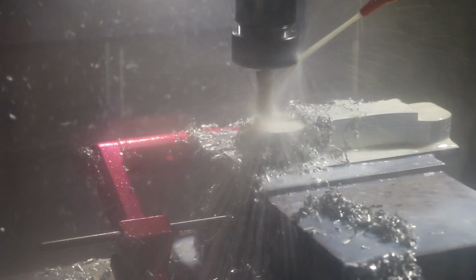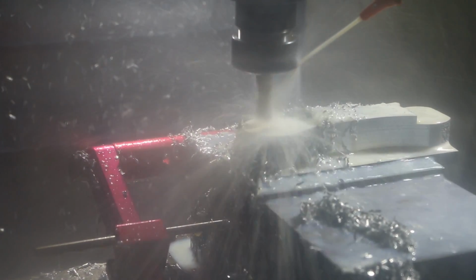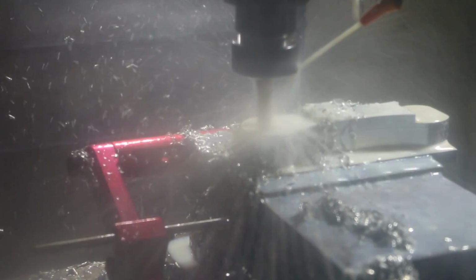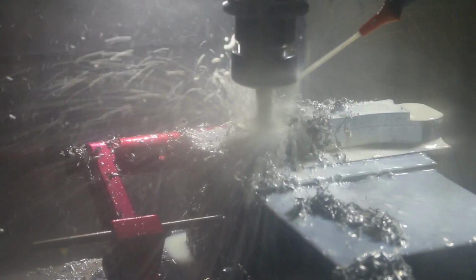The higher end machines, or the newer machines at the same level, have 15,000 RPM spindles or more, and they can move the tables at 1,200 inches per minute and cut up to 800. With that much friction and that much speed, you have some more cooling. Well, the coolant is there primarily to clear the chips out, so that you don't end up welding the aluminum back onto the same place. The lubricant is actually a secondary purpose, but a lot of those machines will have high pressure coolant, so the chips get cleared out.